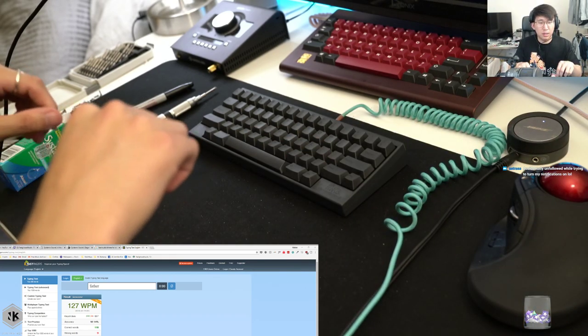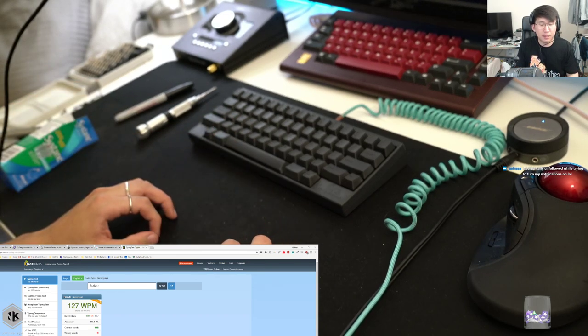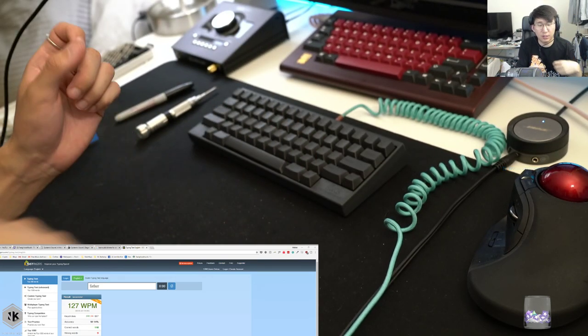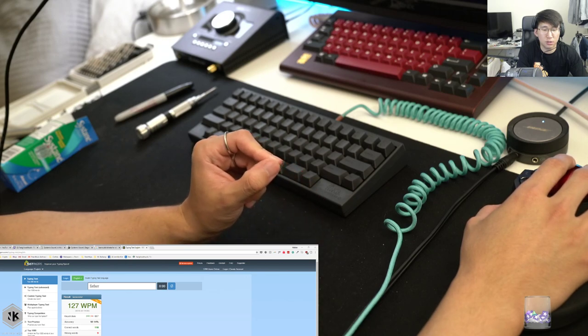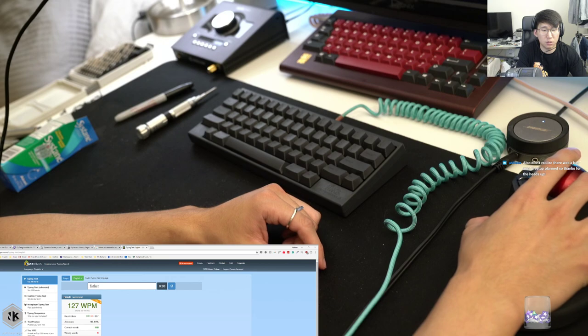You want to have lube in the two clips that clip onto the plate, as well as the two clips on the keycap itself. Just fill that empty space up with dielectric grease. Maybe in a future Alps build, I can show what I do for stabs, because I couldn't show it in my Duck Orion build. But that is what I do.